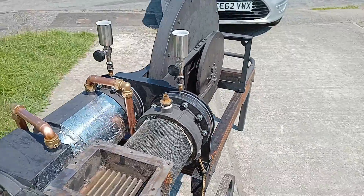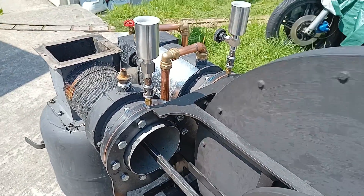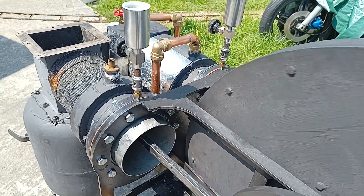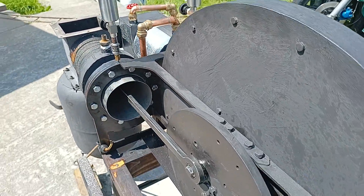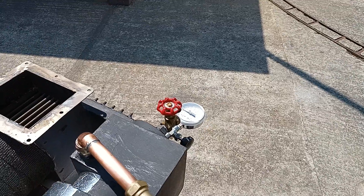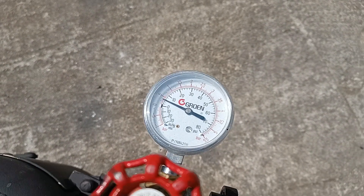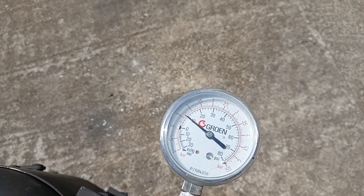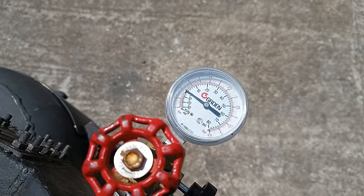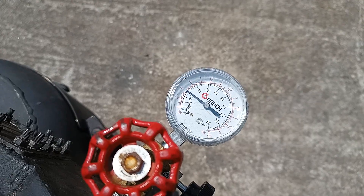Here's the engine outside, almost ready to go. I'll just spin it over without any fire in it so you can see the pistons working. Everything's a bit quieter now — any noise you can hear is the hissing from air escaping from the shutdown valve. I'll do a quick compression test: with the valve closed, the pressure is about 0.7 bar gauge, so the compression ratio is roughly 1.7 to 1. I'm expecting that will drop as I run it because I expect the leather seals will start leaking a bit more.